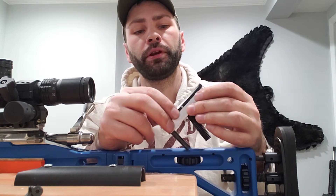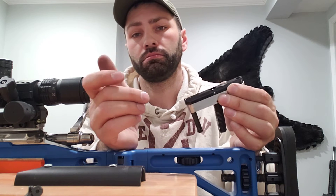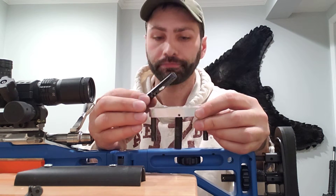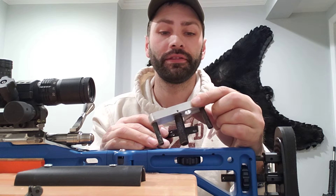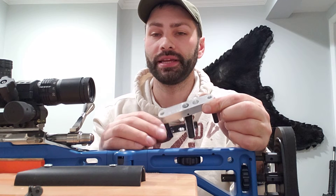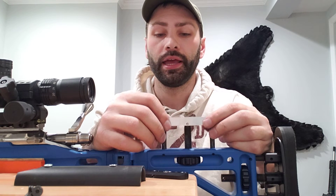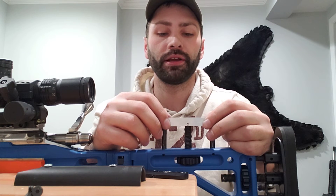It was still glued together and then I put it in my mill — or you can use a drill press — and I found bits that would match up these holes and ran the bits down through. Then you have to drill a hole here for your compression pin. The only hard part was these posts. They're pressed in and you really have to have the tolerance just slightly — the hole slightly smaller than the diameter of the shaft, within a couple thousandths. I ended up modifying these posts on a small mini lathe, just taking a skim cut right off, and they pressed in pretty nicely.